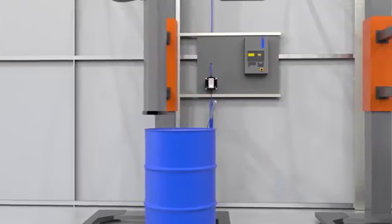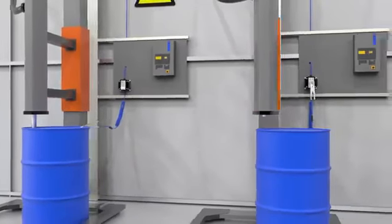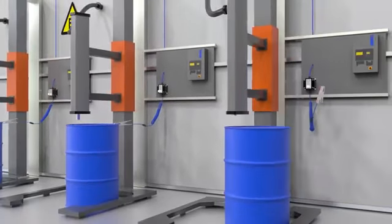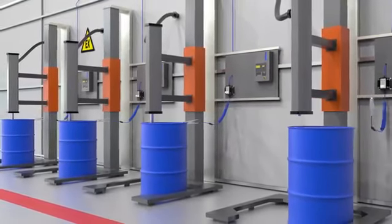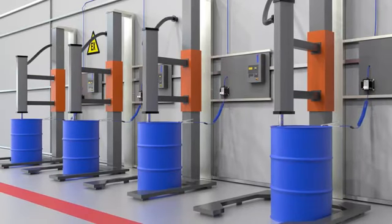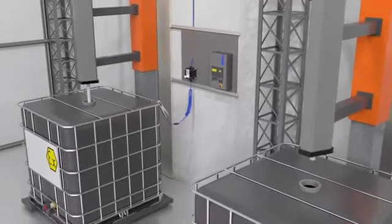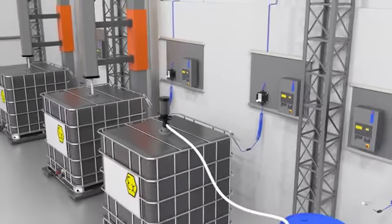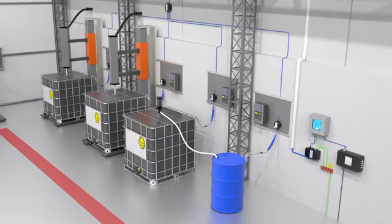When considering a product filling station, an ideal solution would be to have a remote indicator station mounted at each processing point, providing localised visual indication that the monitoring clamp has made a reliable connection to a verified ground of 10 ohms or less when connected to the vessel. It is important to achieve such a connection to ensure the grounding clamp has reliably penetrated any painted coatings, product deposits, rust or any other dissipation inhibitors which may prevent the monitoring clamp making a low resistance connection with the vessel.